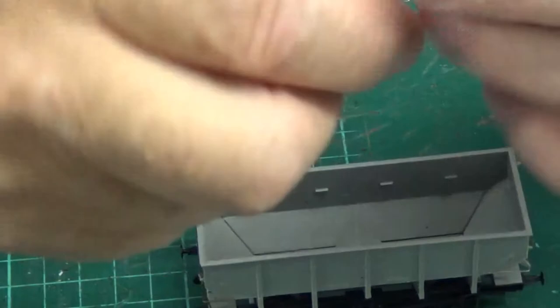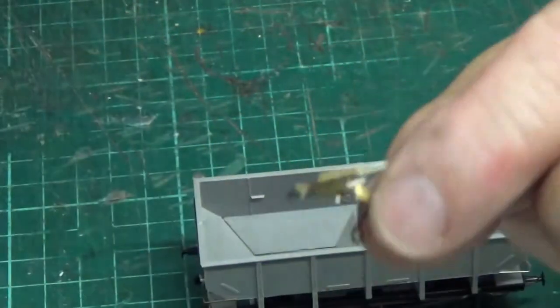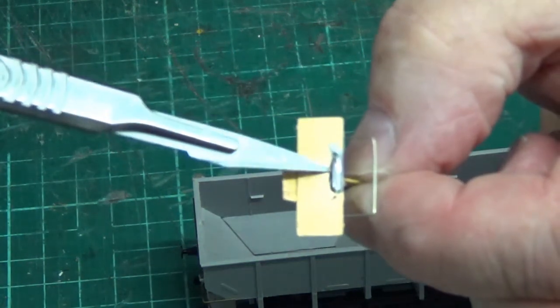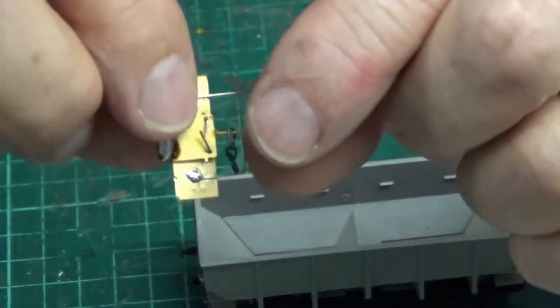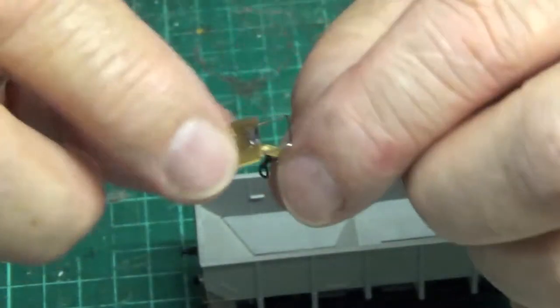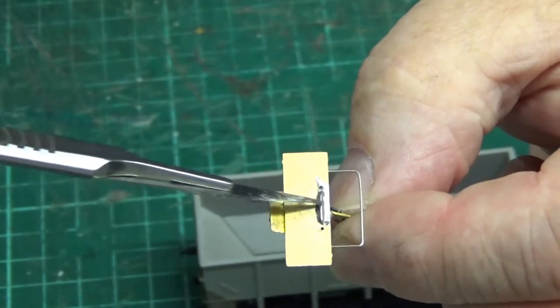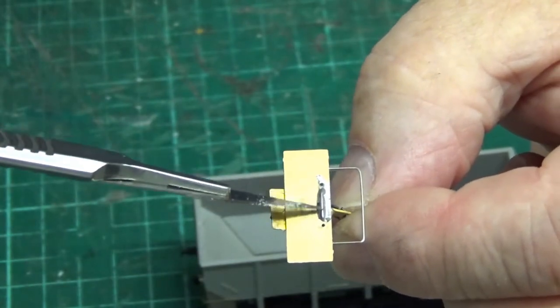And just to remind you what I'm talking about there, if you remember, when we built up the coupling in the last video, we had to use this very small staple type thing through the top to hold the coupling hook on at the bottom. The staple itself acts as a pivot for the coupling hook to move on, and it's that we need the clearance for